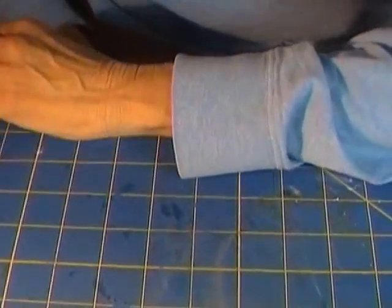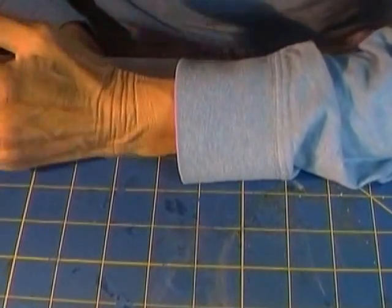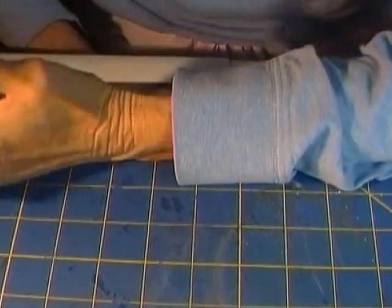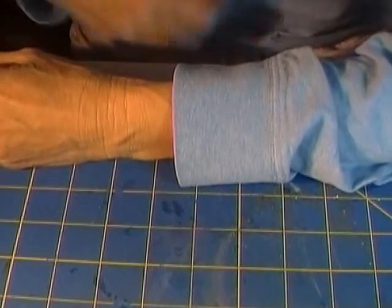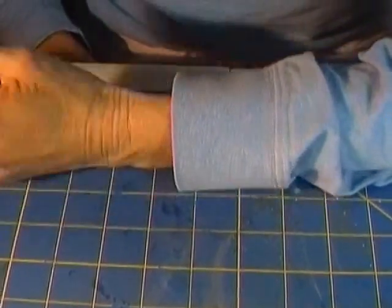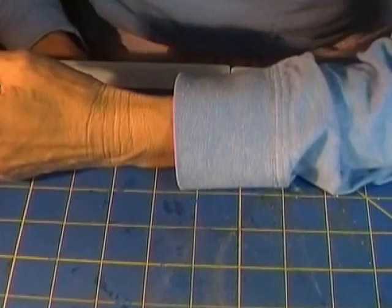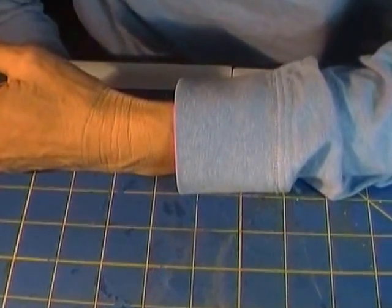When you go to buy it at the store, open the box and look at the bottles. If the hardener bottle is yellow, don't buy it. Just look for a different package. Take it to the service counter even and say, look, this resin is bad, you shouldn't be selling it. Or can I exchange it for a fresher package? That would be nice. Chances are they don't even know.